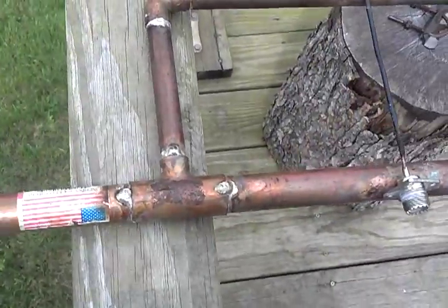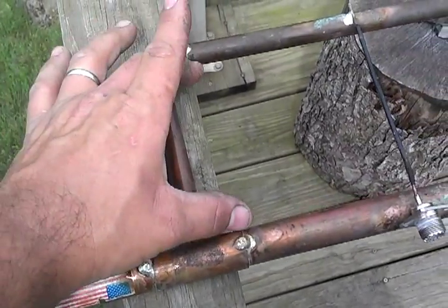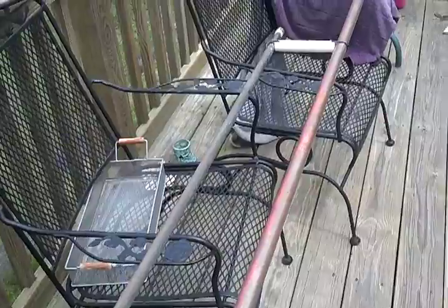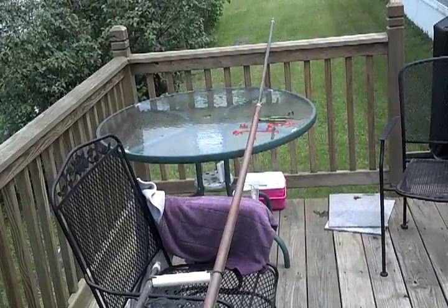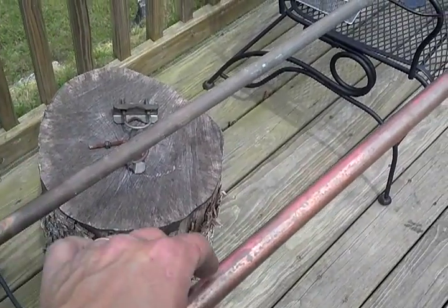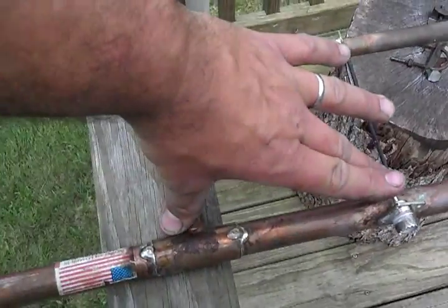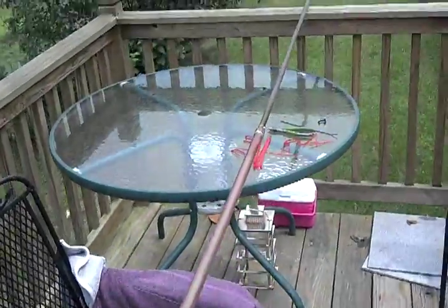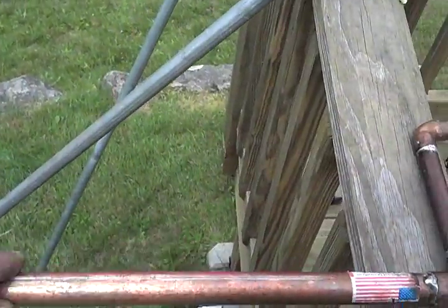The measurements: this piece here is 20 inches, this piece has a five inch space, this leg over here is 56 inches which is the matching stub, and the main section has an overall length of 168 inches total. So again: 56 inches, 168 inches, five and a half inch space up on the matching section — that's tuned for 50.125 MHz. There's the copper J-pole — it's a monster, overall height 14 feet, and 20 inches for the base.